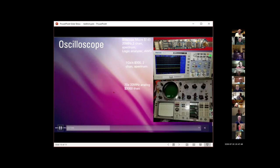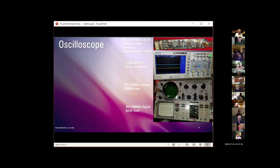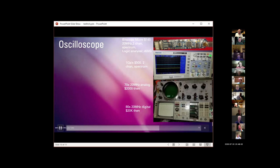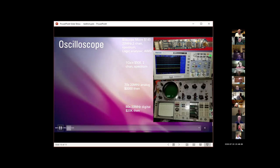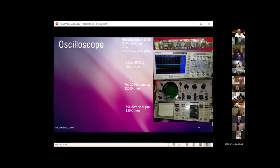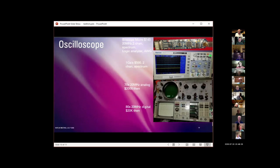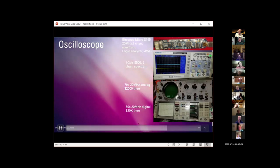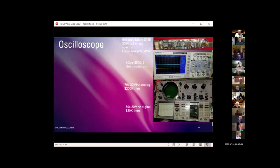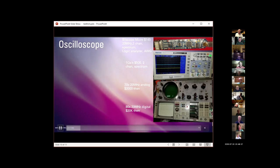I wish we were in person because I'd love to see a show of hands if anybody recognizes this thing. This is a Hewlett-Packard 1980 oscilloscope. The project was started in the mid-70s with introduction dates scheduled for 1980. It is the classic example of snowballing featureism. It was originally defined as the world's first pocket digital oscilloscope. The actual introduced product weighs around 80 pounds and pulls 800 watts. And it's a 20 megasample per second digital oscilloscope that sold for around $20,000. It was a disaster and introduced 5 years late. Anyway, it's somewhat embarrassing to know that I actually have one.